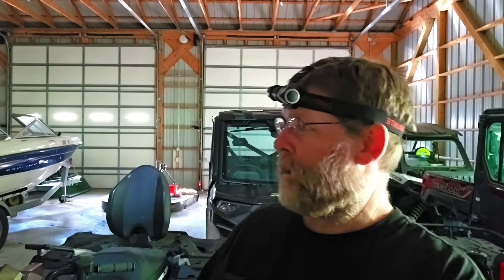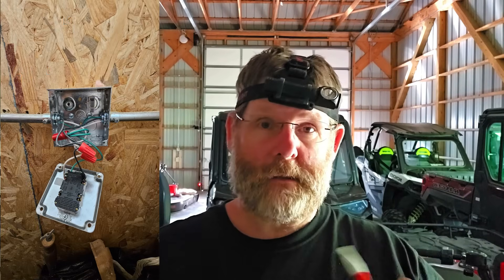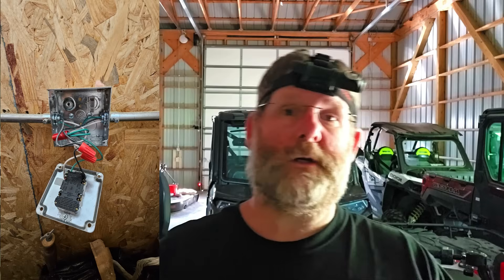So as I was going around, we're going to go to the other side in a few — same thing, except the GFCI would never reset. I went through one box, pulled it out. The electrician that was helping me had just bypassed the GFCI altogether, put it on the load side so it would feed everything hot with no issues. I guess he couldn't figure it out.